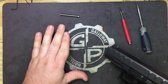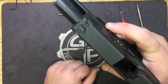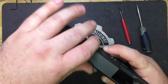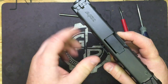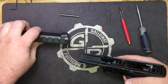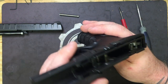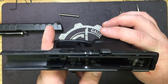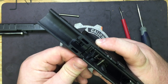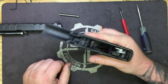So we're going to eliminate that with our striker guide and striker spring. Let's go ahead and rack it. The Beretta APX is a little bit different in how it breaks down. You're actually going to push the takedown out at first, like so, then turn it down. Pull the trigger and you can release the slide from the frame. Anyone familiar with the Beretta Nano — when you look down inside this thing, it is essentially a Nano on steroids. It's very obvious they got a lot of design elements from it, which is good because that is a very simplistic gun that works very well. This works very well also.